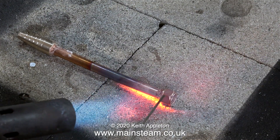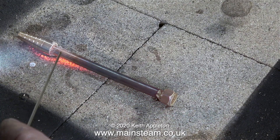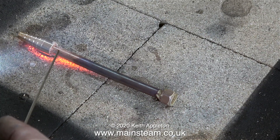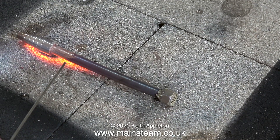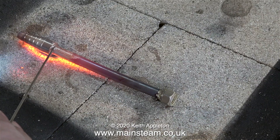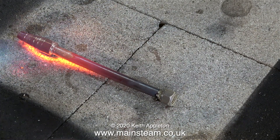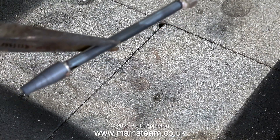I drilled out a union nut part of the way through so this pipe actually wedged into the union nut — now I can silver solder the union nut directly to the pipe. You will notice that I'm waiting until the flux takes on a watery appearance before touching the joint with the silver solder. If you touch the silver solder stick on the work too early it will just blob all around the joint, but if you put it on at the right time it flashes around the joint by capillary action. It's very important not to put it straight into water to cool it — let it cool to black, then drop it in a pot of water; the thermal shock of quenching removes some of the oxidization.